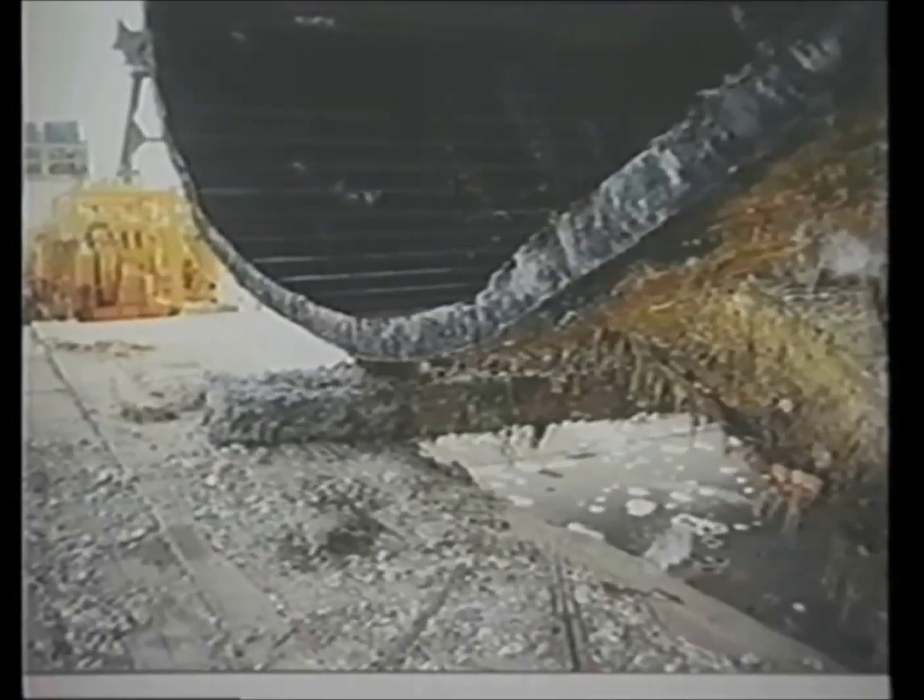This steel you're looking at up here in the right-hand corner — that ugly burn — was caused because topside did not pay attention to the volume of the O2. As the volume dropped off, the pressure dropped off, and the change in pressure caused this bad, ugly burn.